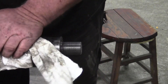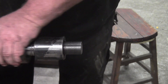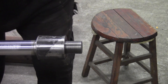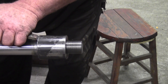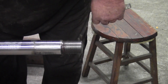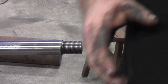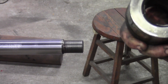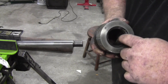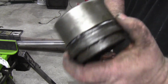This next part looks like a chunk of mild steel, so we can probably make something out of that. And there's the gland. What you would do if you had a seal kit is just pick the seals out — it's got a snap ring on this one to hold it in — and just change the seals. The gland piece is also mild steel, so we may keep that around for something else.